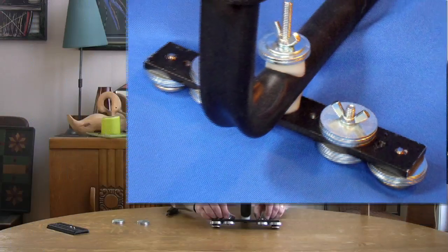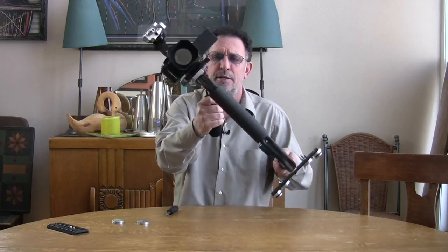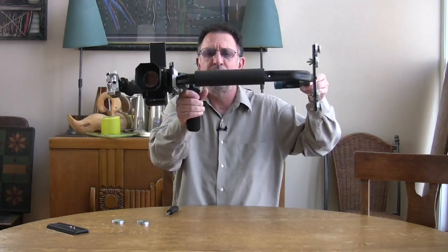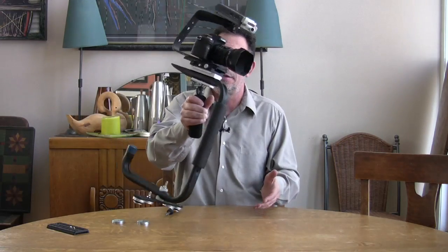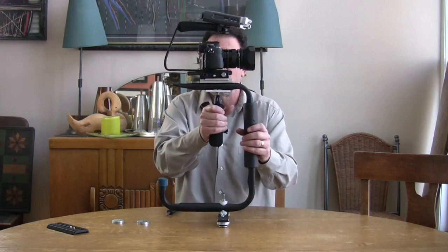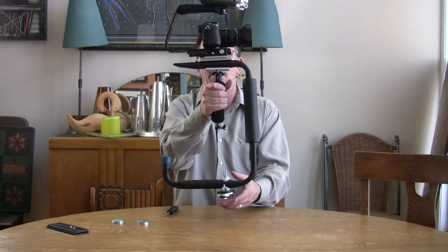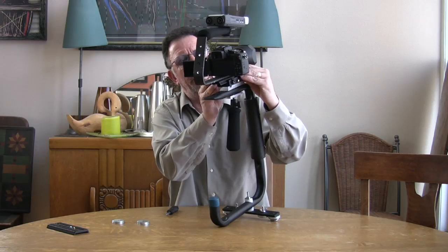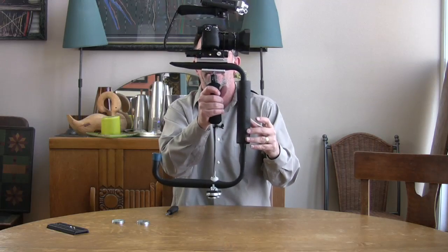This weighting is very touchy — it's a matter of grams. We'll lift it up again and see how long it takes to right itself. Okay, that's about a one-second count, so we're getting there. Once you get the counterweight right, you'll notice that the front-to-back balance may be off just a little bit, so I'm going to slide forward a couple millimeters using the adjusting screw. Now I've got good front-to-back balance again.